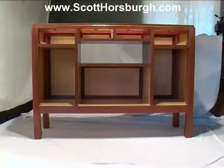So the backs really are the last thing that you would glue in place once you've fitted the doors and drawers and the top. By putting them in last, it enables you to have free access from the back, which is handy when you're fitting door catches and drawer stops and just striving for that perfect fit. It enables you to see when things are connecting and when they aren't. You can also see how the back would greatly help to stiffen the carcass and add to its structural integrity.